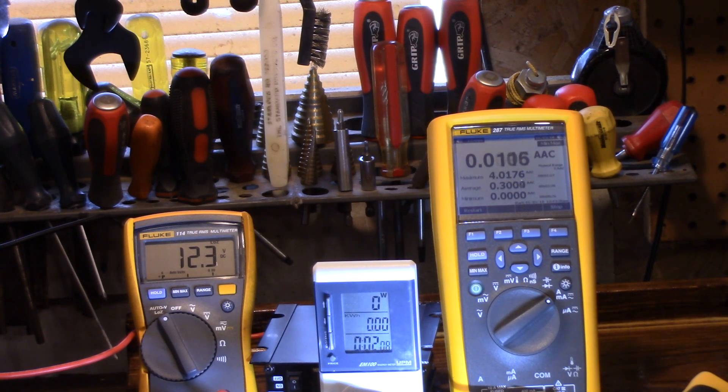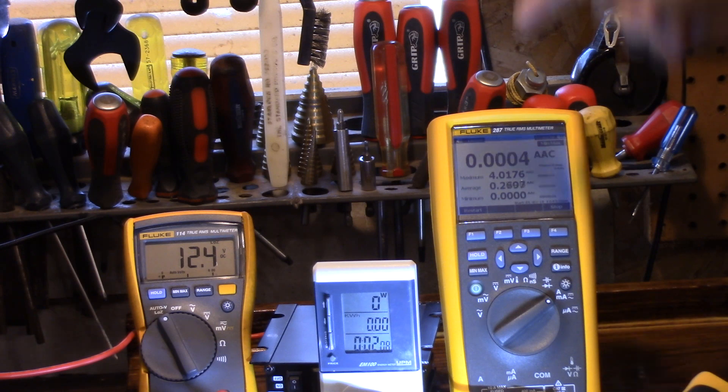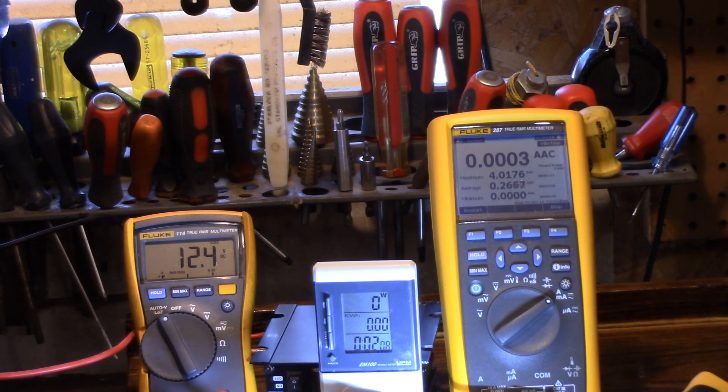It's about 200 watts, which is more than the maximum. You can see that what's happening is it's only going to allow that for a certain amount of time, and then it's going to shut it off — it'll overheat for sure. I was surprised that it peaked out at 4 amps, then of course it would drop and drop as you're using it. I thought that was a valid experiment showing the reason why you can't join two ports together.